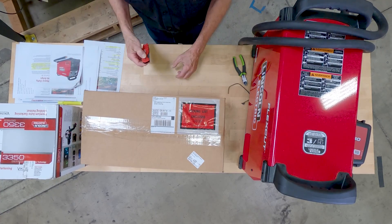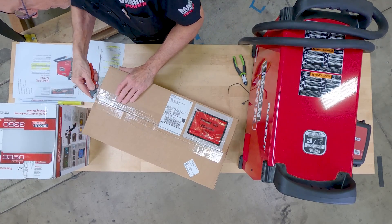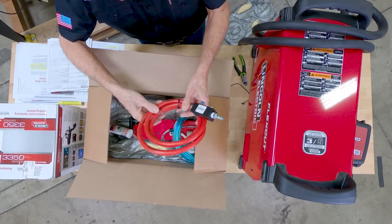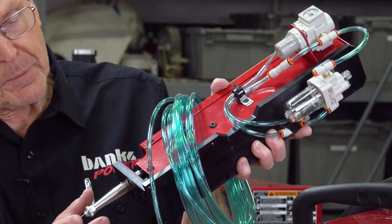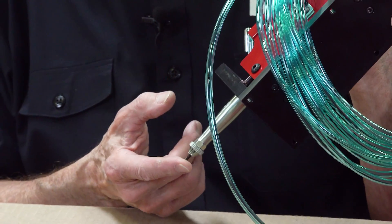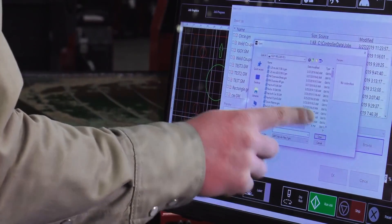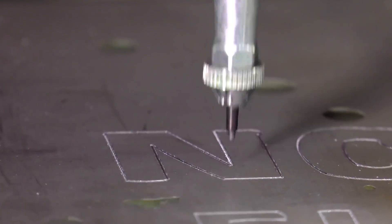This one's our mystery box — I'm not quite sure what's in here, but let's find out. This is our plate marker. It's air powered, has a little punch, and mounts on the gantry. Off your CAD, this will give you a center punch to drill a hole within four thousandths of true location — which is pretty damn accurate. But the other cool thing it does is you can punch a design, a logo, a part number, or instructions that will permanently be on the workpiece. I can't wait to have the plate marker fired up — I can't wait to fire up the whole damn thing.